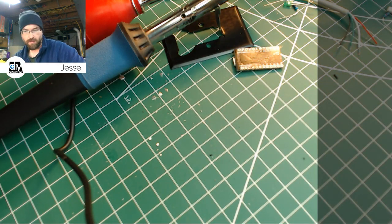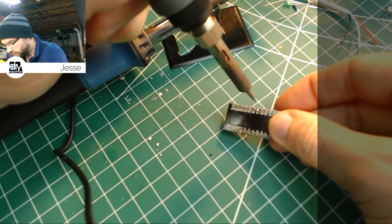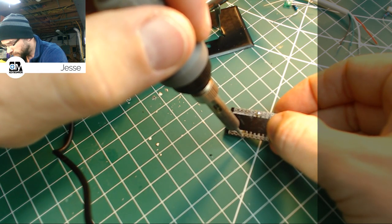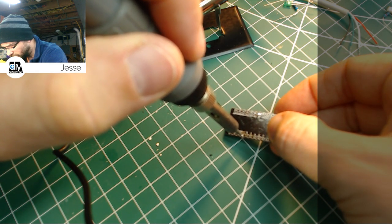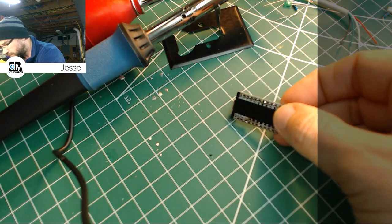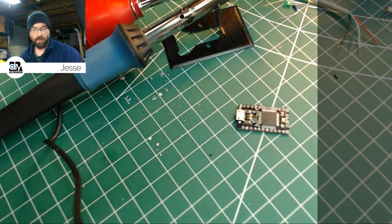Look at that. Perfect. Now, I don't know if you can really see, but we have a few pins here that are still filled. And we can just melt them as we go, basically. What I don't want to do is get to where we start lifting pads from stressing it. The holes are clear, they're just filled with solder, so no big deal. So our Pro Micro is free,